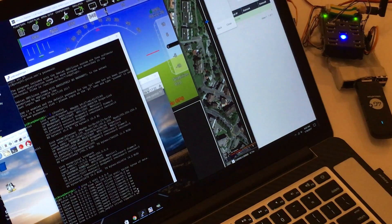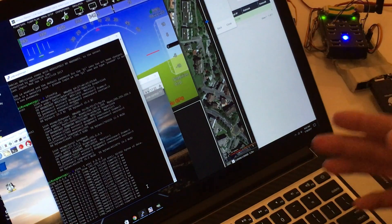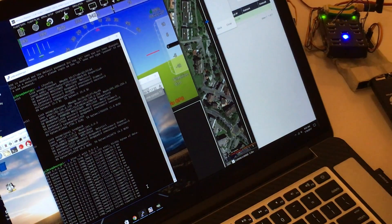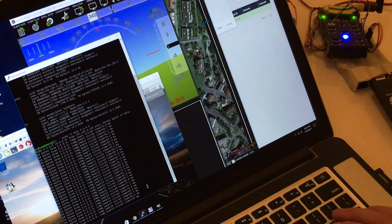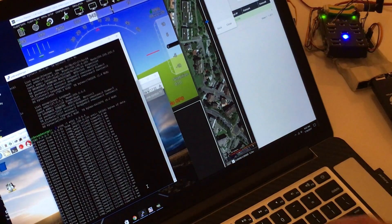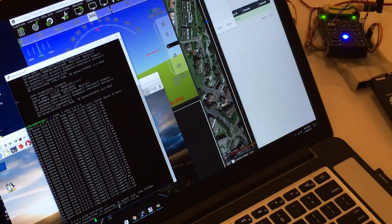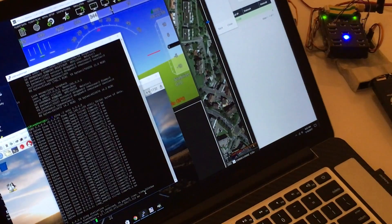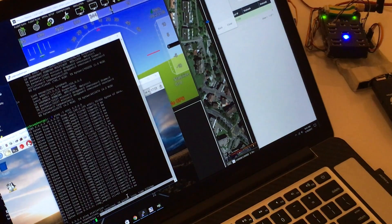You can see the results: 75, 80, 86, 85, 74, 85 milliseconds. In my house my phone only gets a 3G connection, so this is probably on 3G right now. 33 packets transmitted, 33 received — 100% transmission, zero packages lost. The latency: 67ms is the lowest, 82ms is the average, 100ms is the highest, with a standard deviation of 7.3. I consider that low latency — below 100ms is the highest we get, and that's pretty good.